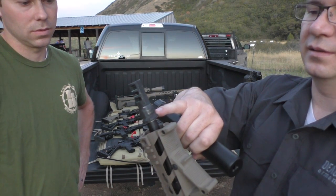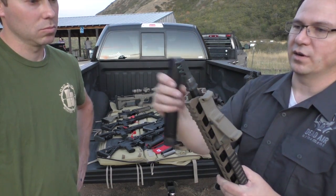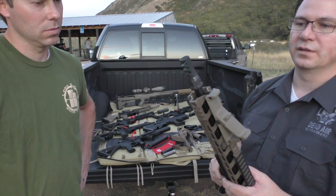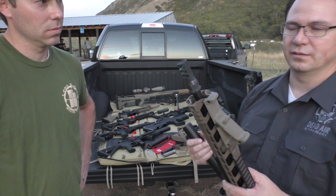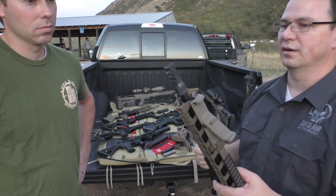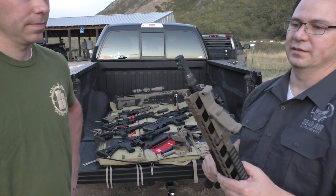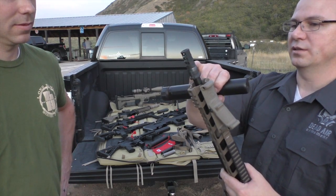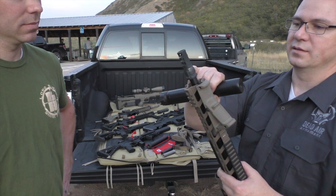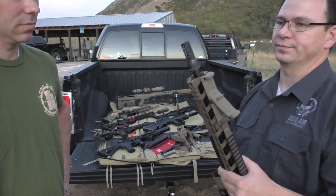That carbon is what locks it on in a lot of cases. If you have contact points out here on the distal end of the mount, you're going to get carbon built up in there, and eventually, when you go to take it off, it's not going to want to come off. A lot of times you need to get solvents in there. Sometimes you have to loosen the attachment features and shoot it off. So ours is made so the contact point and the alignment point is on this taper where the seal occurs, and then behind it, so that the carbon fouling doesn't get into that area.